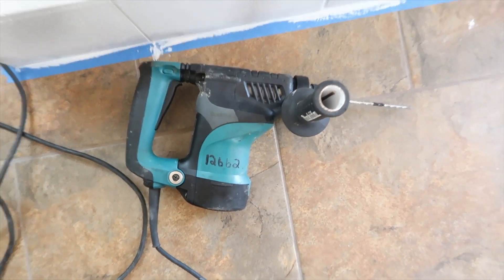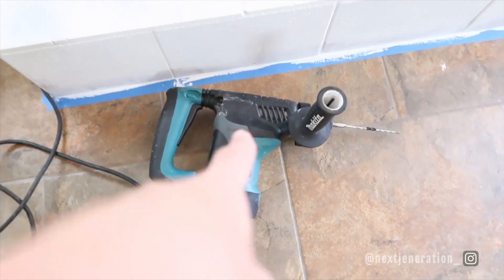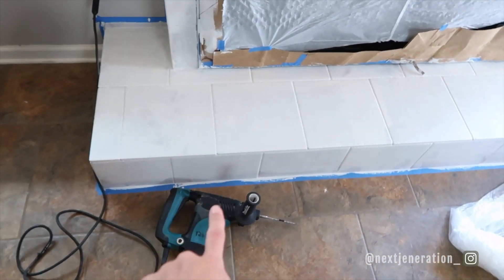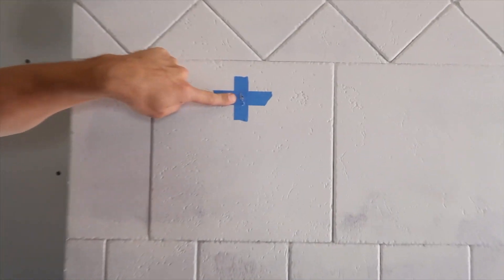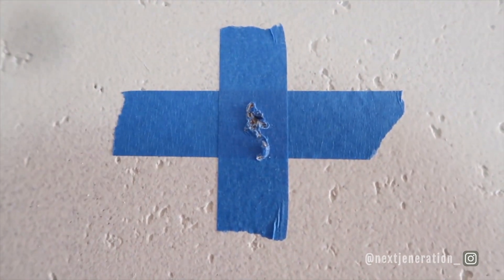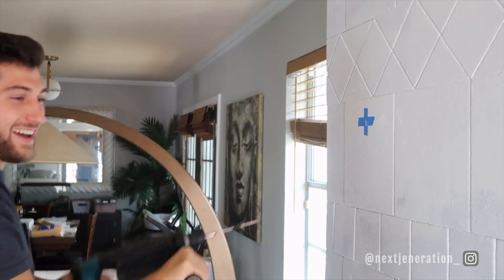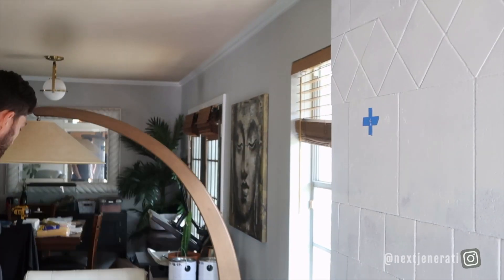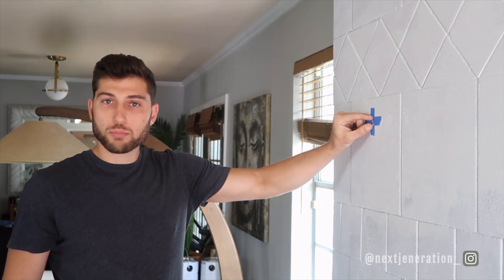We had to rent a hammer drill because we're drilling into brick and a regular drill did not work at all. If you have brick, concrete, or masonry, a hammer drill is the easiest way to add your mantle — it's the only way. The regular drill bit barely even took the paint off the wall. Using tape to hold the bit in place on the tile helps prevent it from sliding and prevents chips from breaking off. We used a 3/16 bit with quarter-inch masonry screws.